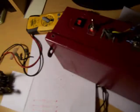The cool thing about it is if you're an HVAC contractor like I am, you can control these solenoids which allow flow or bypass it. You can do this without using your transformer in your unit or turning it on and off by the thermostat. This is a good way you can test it — just connect those two leads and either turn it on all the time or use that push button. Thank you for watching the video and I hope you enjoy.